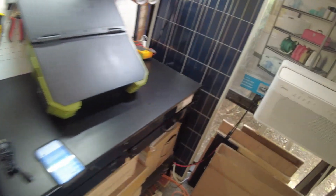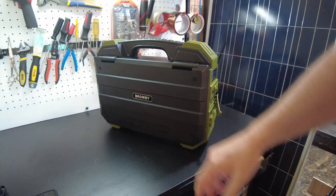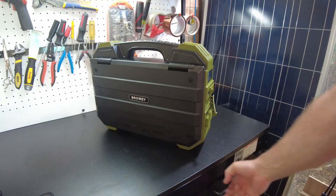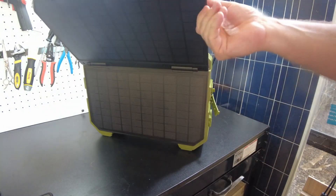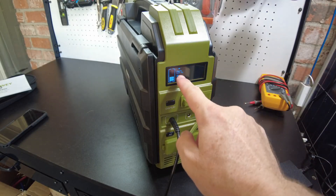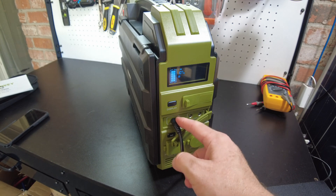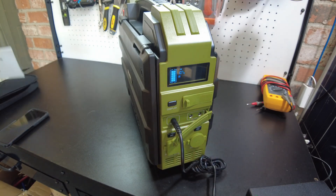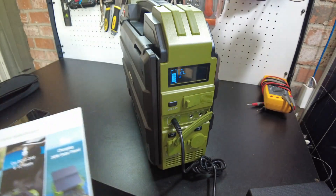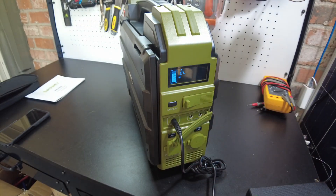Keep that in mind — you probably don't want this to be your only method of charging. I'd see this as an emergency method: if you don't have any power anywhere else and this is all you've got — the zombie apocalypse is here and you threw this in the trunk of your car — it'll eventually charge it up. Let's try charging with the included power adapter. It's showing 107 watts. The unit specs 120 watts at 5 amps, but the manual says the input is limited to 4.5 amps, so you're limited to around 100 watts.